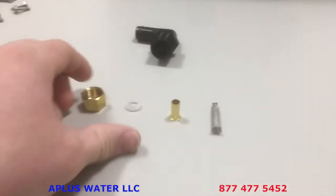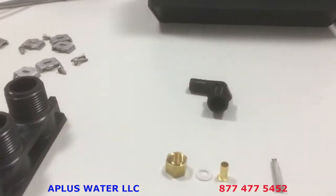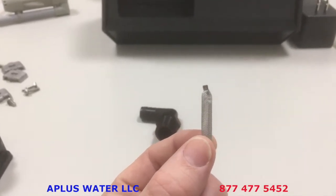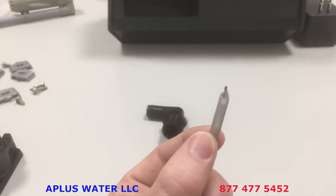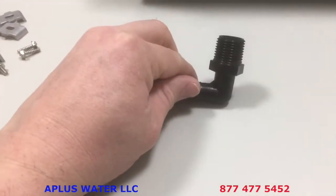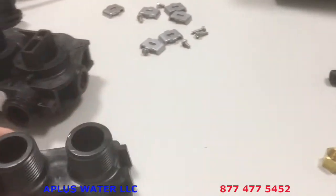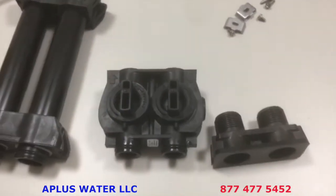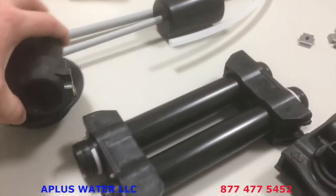You'll have some small fittings — a brass compression fitting, a ferrule fitting, and a little stabilizer for the brine tube. You also get a small screen, but we suggest you throw that away. There's an internal screen that gets backwashed with the unit, so you don't need it. You'll also get a drain line, a yoke, and a bypass in either three-quarter inch or one inch, along with crossover tubes to connect two tanks for the resin.